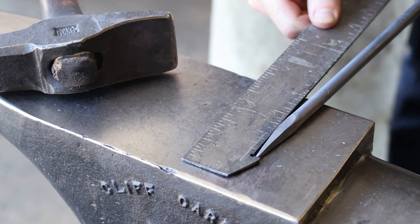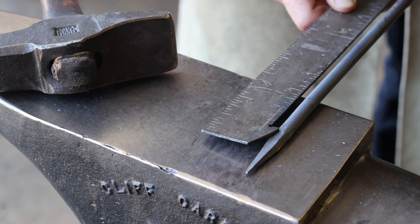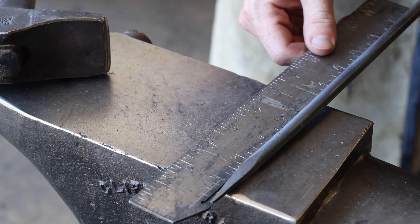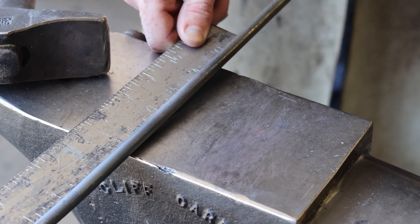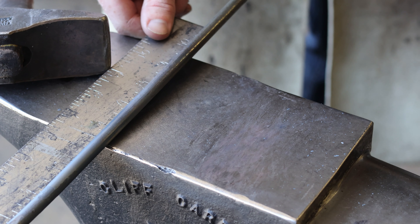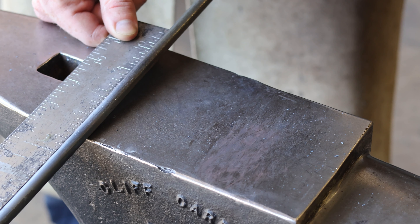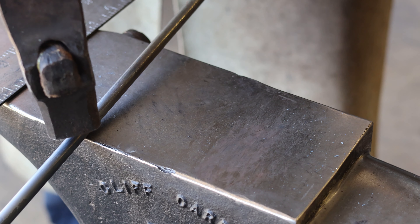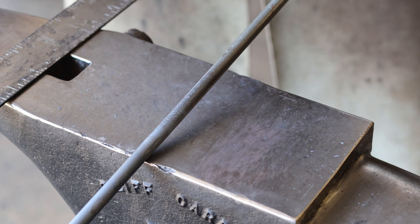Working a little cold so that I don't crazily deform my bar. That's right about 1-3/4 inches. So what is our overall length here? There is a slight difference between the two, but that's not going to make too big of a deal. The overall length is just over 7-1/2 inches, which means I'm definitely going to need to trim this down and reforge one of these tapers, because 7-1/2 is a whole inch longer than intended.